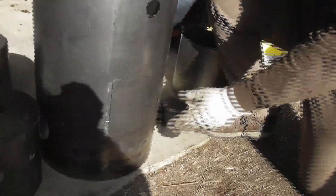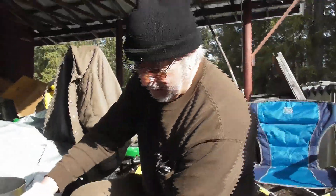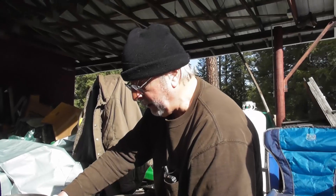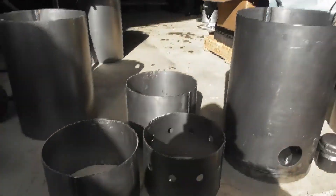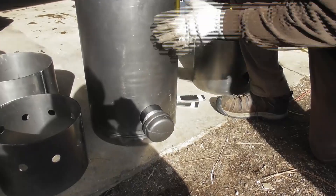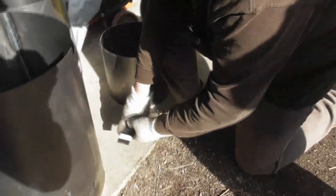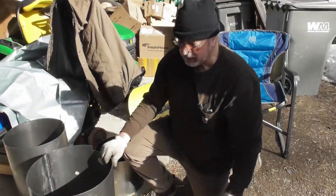The other thing is we're going to cut out where the gas exit is. Notice this piece of metal is left in here — that makes it easier when rolling so the metal doesn't get distorted. It's actually already cut and only held in place by four tabs, so we just need to cut those tabs off and we'll have the opening. Same thing on the reduction tank — it has those same plates in there. We're going to cut that out, set it inside here, put in our 3-inch clean-out, and put in a frame here for the gas exit, which will get welded to the reduction housing inside.